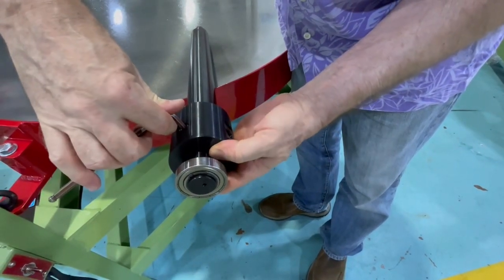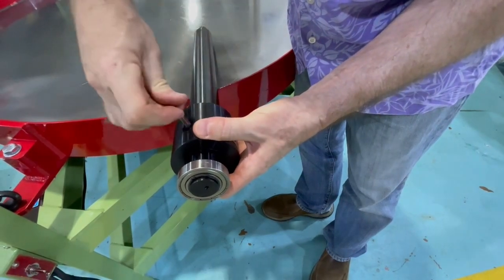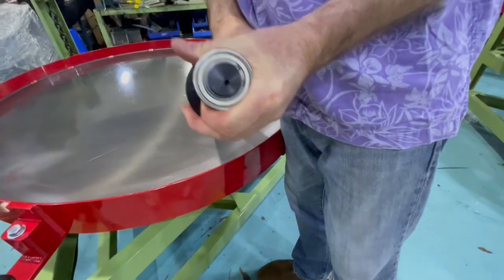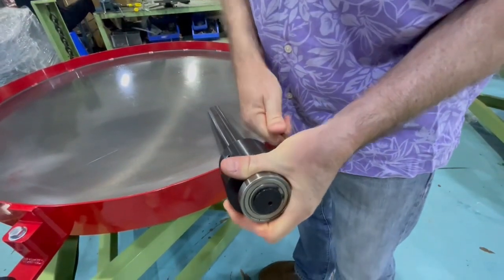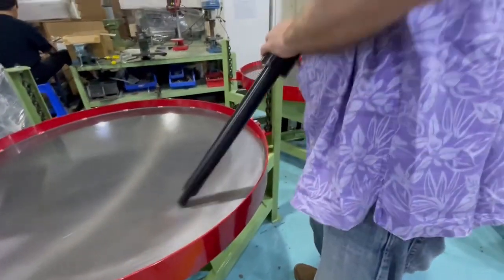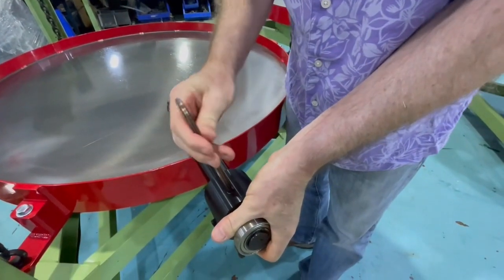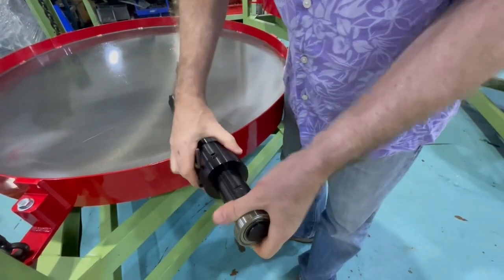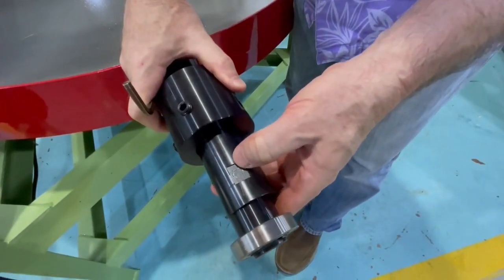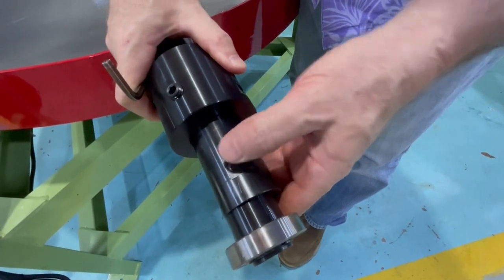And then when I'm tight, when I tighten it and crank down on this thing here, and then if I take it back off, you'll see the set screw will have made a round mark instead of a crescent-shaped mark. See, now when I tighten it back down, I got a round mark here. That tells me the set screw's all the way down on that flat.